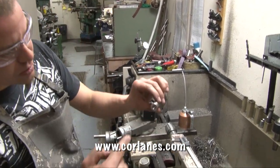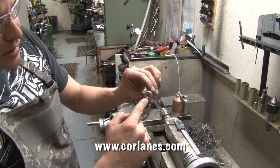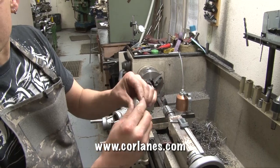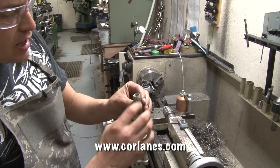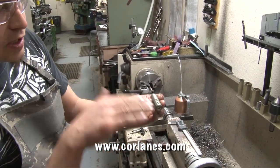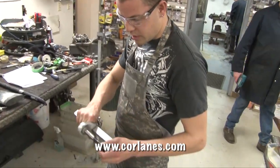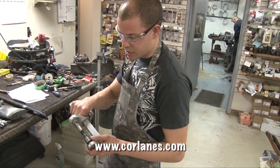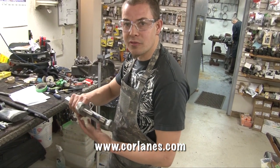So now we have a brake with the proper size pilot through it for a .30 cal, and a nice little chamfer on both edges so they're nice and soft and not going to cut or feel rough. Now I'm going to chuck this up on a mandrel and finish the rest by hand. We chuck it up on a small spinning device so we can polish the brake up nice, do the edge, and make it look beautiful.